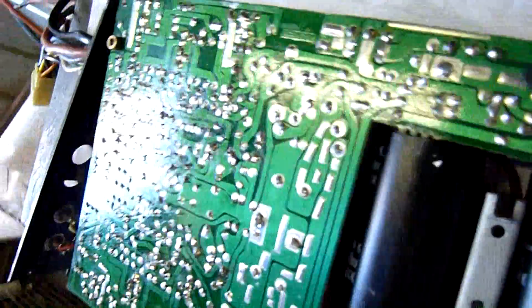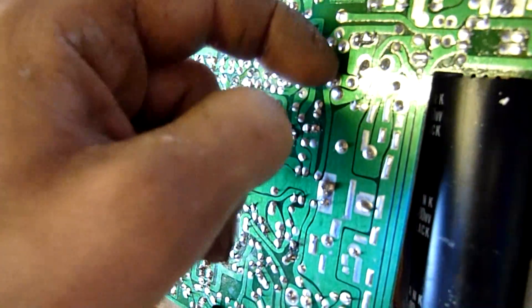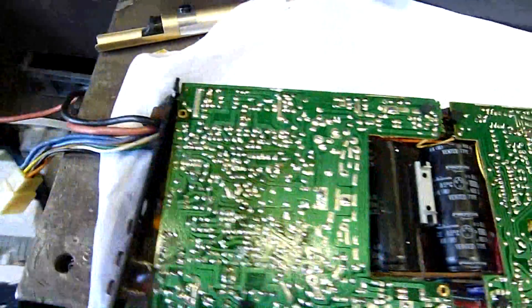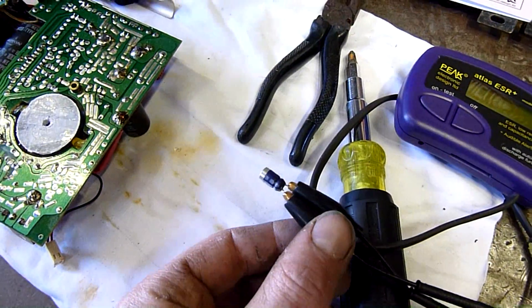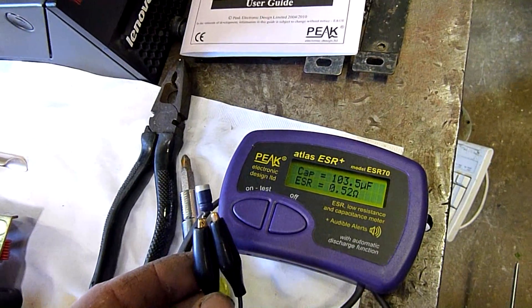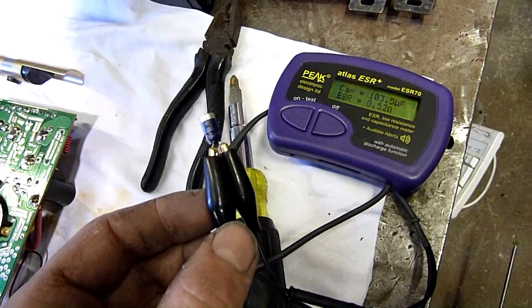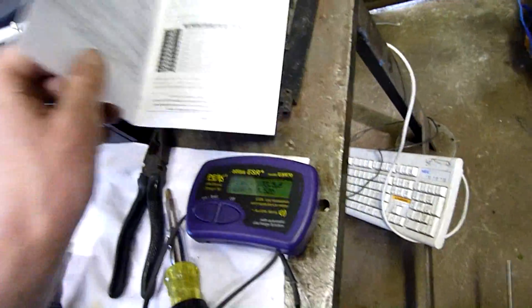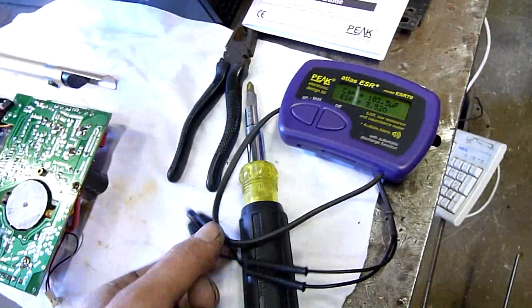I just found a big one here - look at that. Let me get my fingernail under that crack. It goes to one of the blue wires, which is probably one of the outputs - right speaker positive. That's not good. As bad as that cap looks, it's still within spec. It's 100 microfarad 10 volt, and by the book a 100 microfarad 10 volt can read up to 2 ohms. This one's 0.5 ohms, so that's actually better - there's less internal resistance. Higher resistance or short it'll tell me, but that's fine.